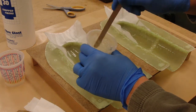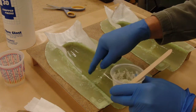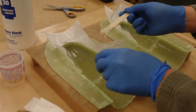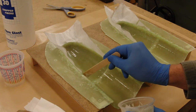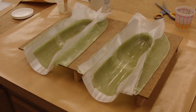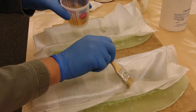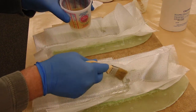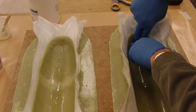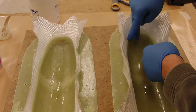Just like when making the mold halves, we'll need some thickened epoxy. In this case, I've used fibers to help make a step where the surface of the nose steps down from the shoulder. Here's the first layer of 6-ounce cloth applied, and we will go ahead and finish out the other two layers using full-length pieces now. It's helpful to have the cloth slit before you start working so you can get it into the curves. The layers go on quickly, and once we have our nose cone to the desired thickness, we just need to make sure all the cloth is wet and we don't have any bubbles.